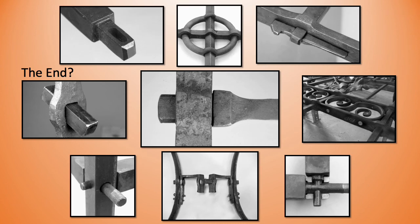This is not quite the end of the tutorial. Once you get good with your punching, punching and drifting is just the beginning — now you're looking at your design. One last thing: if you're punching to accept a tenon, punch from the rivet side. That's going to suck the material from the rivet side leaving a slight concavity, but it will give you a nice square shoulder edge for your tenon. Punch from the rivet side going towards the square shoulder, and that concludes this presentation.